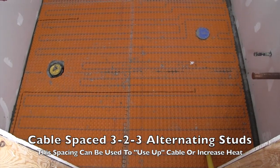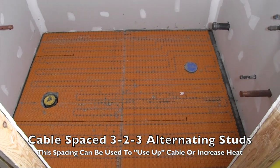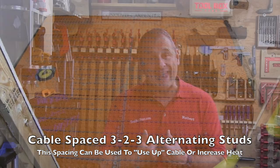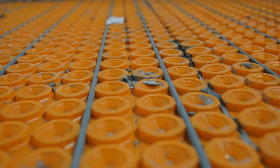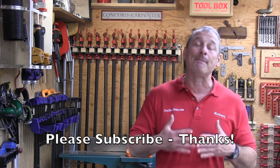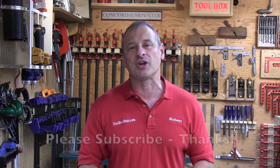Once you've done all the testing and it's installed, you're ready to go. When the electric heat kicks on in this bathroom it heats up fast, and the concrete subfloor is absorbing less heat energy. Here's a pro tip: because this bathroom was in an unheated space, we added a door closer mechanism to keep the door closed at all times so it can't be left open. This is good for heat conservation and prevents the thermostat from activating more than needed. If you like this video, please give us a thumbs up and consider subscribing. I'm Rob Robillard — we'll see you next time here at Concord Carpenter.